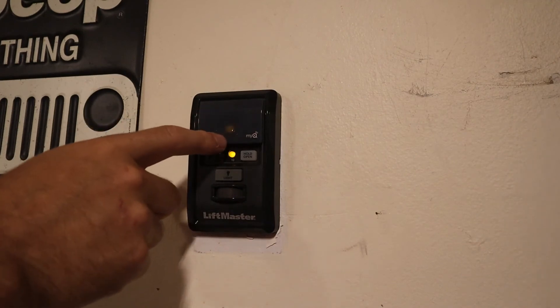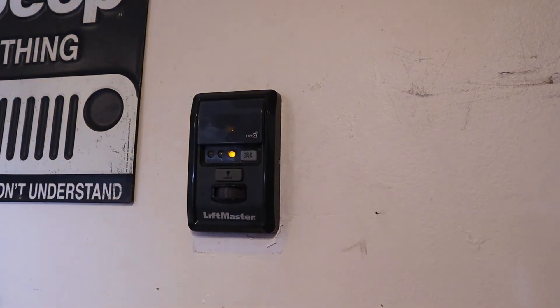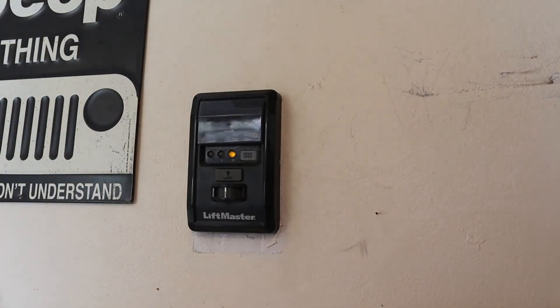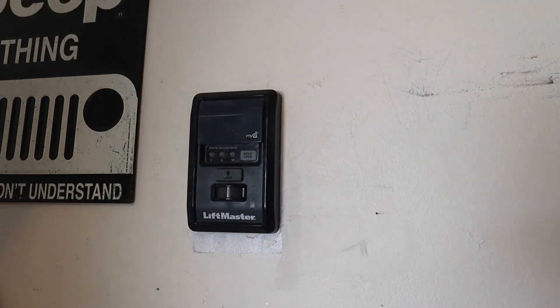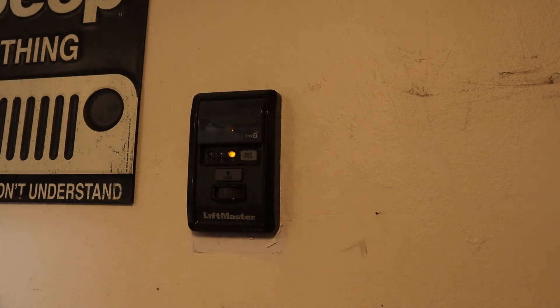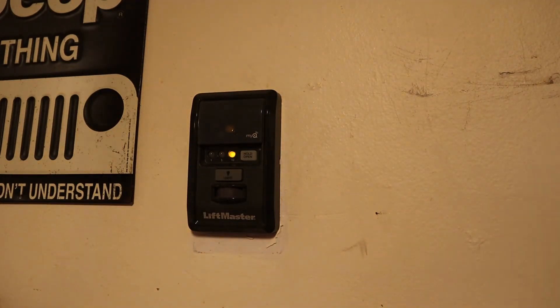Let's test it out — we'll open the door and then close it. I hear a door opening, it's getting brighter in here. Door is open. Door is closed. Alright guys, I think that's a wrap. As you can see, this is not a very difficult repair. By far the most difficult piece was just removing those old caps — sometimes the solder can fight with you. Hopefully we bought a new lease on life for this thing, because this is a $40-$50 keypad and these capacitors were less than a dollar a piece. If your keypad is in otherwise good shape, this is a great repair if it's starting to misbehave. I'll leave links to the keypad, capacitors, a basic soldering iron, and a solder sucker in the description. I hope you guys found this video helpful — if you did, please subscribe, stay safe, and thanks for watching.